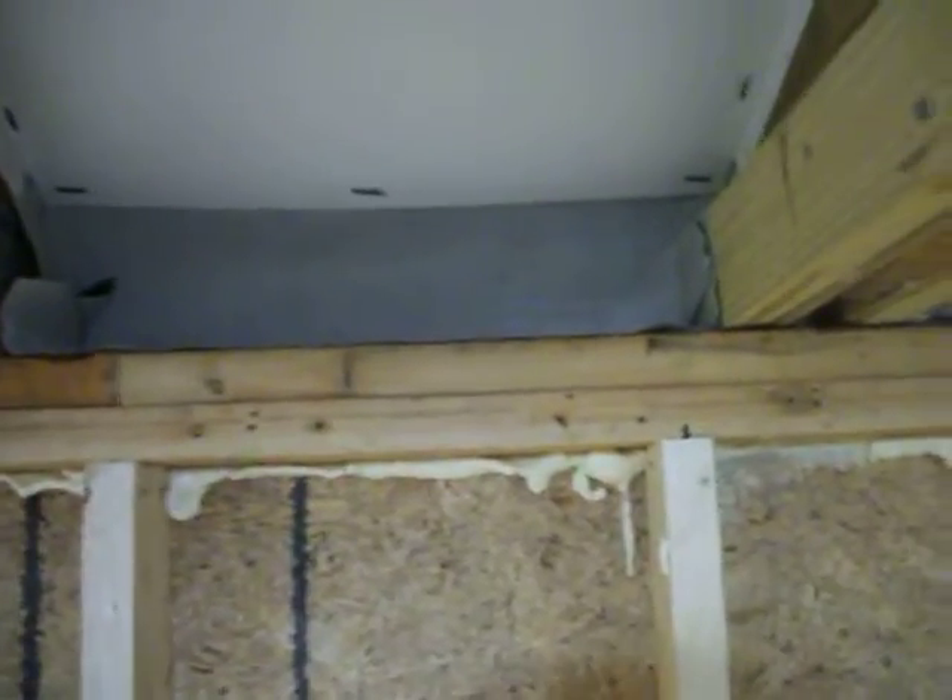Now you can see why the flexible section is necessary — it goes in the top of the roof and will hold the insulation. Eventually there'll be drywall up here and blown-in insulation like there is on the backside. The baffles will prevent the insulation from plugging up the soffit vents, and will allow a channel of air to go up to keep moisture and heat in the attic to a minimum. These extra-duty baffles are because there's very little eaves, and I want to make sure there's some insulation above the wall.